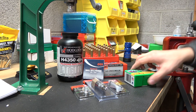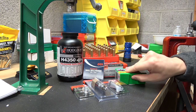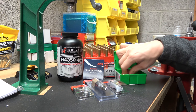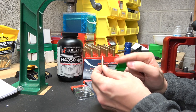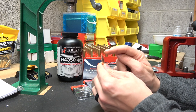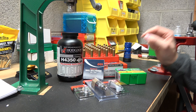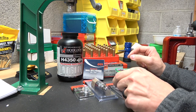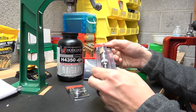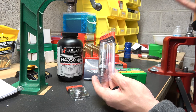What I was saying before is I wasn't able to measure as consistently as I'd hoped. I didn't have a comparator or anything to go off of for measuring to a spot on the ogive of the bullet. All I had was an overall length measurement and those were all over the place because of the meplats on this particular bullet. So I decided that if I was going to do this test, I'm going to do it right. I ordered the comparator body, the 26 caliber insert for the comparator body, and the Hornady MicroJust seating stem that will go on my dies.